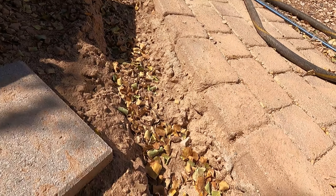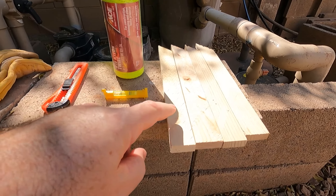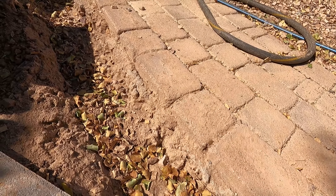I'm going to want to go six inches down for that: one inch for the irrigation line, four inches for the gravel, three quarters of an inch for sand, and then I want to have the pavers. I want these pavers sitting above the paver walkway so that water doesn't run off these pavers and into the shed.